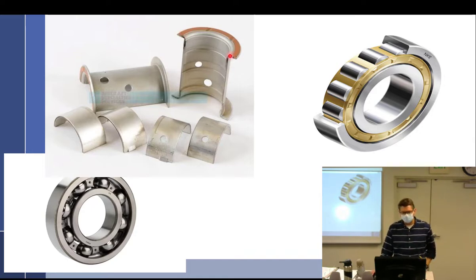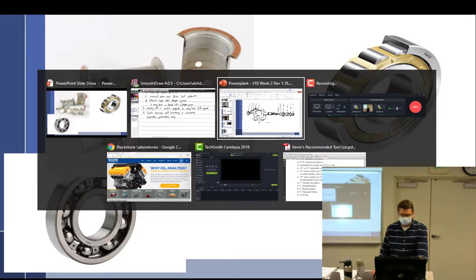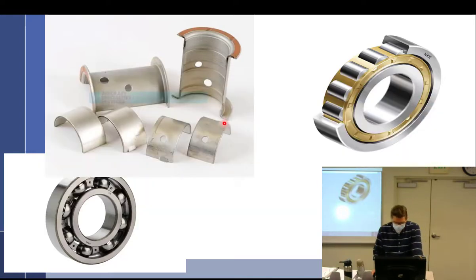You have to be careful because small Continentals use three different styles of bearings. This is a one-piece. They also made them in two-piece where the front bearing was similar but just longer without the lip, and that lip was a separate piece that slides in with a little dowel. If you force it in there, they always crack and break — so that was a bad thing. The Continentals also have an oil slinger, but only one.